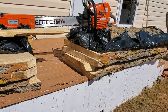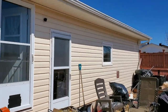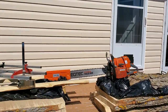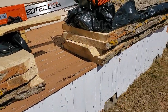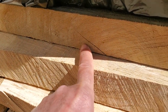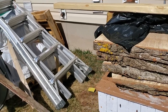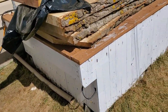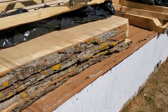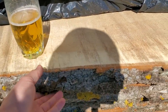They're not dried yet — they have to be dried and cured. I'm going to put them in the upstairs attic of my garage, laying them along the rafters in that empty space. Somebody mentioned I should paint the ends so they don't split — you can see this one is already splitting. I'm going to paint those ends soon, then get them up into the garage. They're a couple hundred pounds or at least 100 pounds each. Hopefully they dry up nicely and I can make some tables, benches, maybe a desk. They've got a beautiful live-edge bark on them.